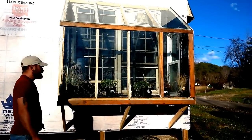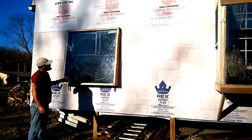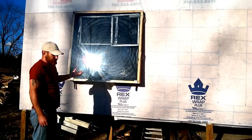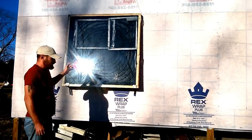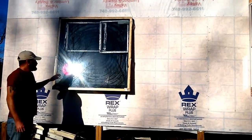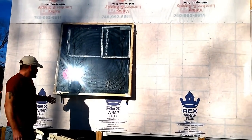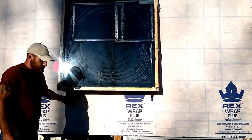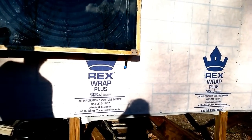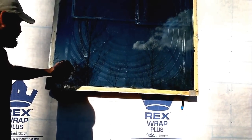In between this, I have this thing here — this is a solar window heater. This thing gets 120 degree heat coming out of it on a sunny day with 40 degrees outside, and that 120 degree heat goes back into the house. All this is is a box with a piece of glass over it. It has window screen on the side of it and tubing inside. I put a brand of tubes inside of it — if I ever want to heat water up, I can. I don't have it hooked up right now. There's a little tube in the wall here with a fan in it that blows air out of the house into this box.